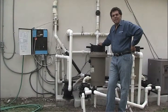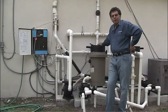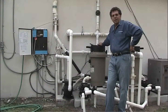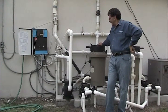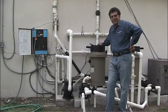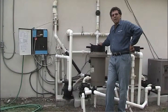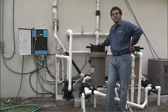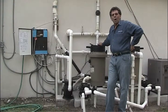An EC65 filter should be dismantled and professionally cleaned every year, preferably during the winter time before the spring of each year. However, if you find yourself having short cycle times, in other words, when the filter pressure increases very quickly after bumping and you've put in fresh diatomaceous earth, and shortly after that you still have the same pressure increase and decreased flow, my suggestion would be to do a filter wand cleaning, which is a very simple process.